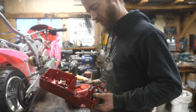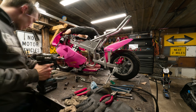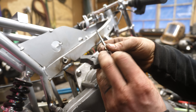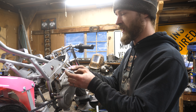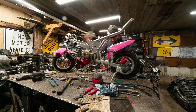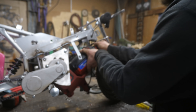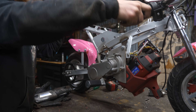I'm going to cut out this chunk of the chainsaw body and try to cut it in such a way that I can also use the battery clip part of it. I took this little clip end off the carburetor where the cable originally attached, and just drilled a hole in the side of the trigger here and put the clip back on so it can pivot as it pulls up for a nice smooth action. Got the battery in there and you should be able to pull it out with the fairing in place, which is key because it's going to need to be swapped out pretty frequently.